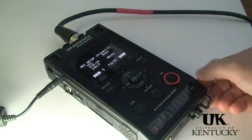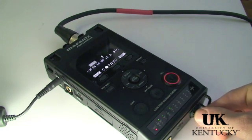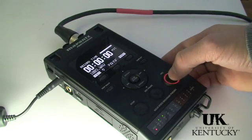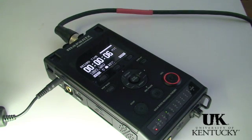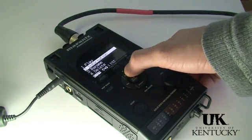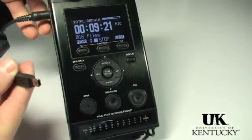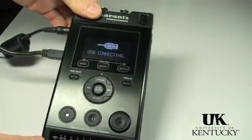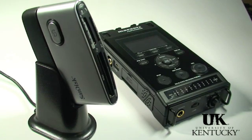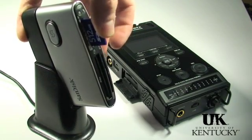To record, first press the Record Pause button to sample the recording levels so that adjustments can be made. This will cause the record LED to flash. To change the image displayed on the screen, press the Display button. Adjust the levels with the Recording Level Control. When you're ready to record, press the Record button. The record light will hold at a constant red during recording. Press Stop to end recording. When you're ready to play back your file, press Play Edit. To connect the 661 to a computer for file transfer, simply plug the USB cord into the 661 and the other end into the computer. The 661 will read USB Connecting when connected to a computer that is on, and the recorder will pop up on your desktop like any mass storage device. Another alternative would be to pull the card out of the recorder and put it into a card reader, then plug it directly into your computer — it works just the same way.